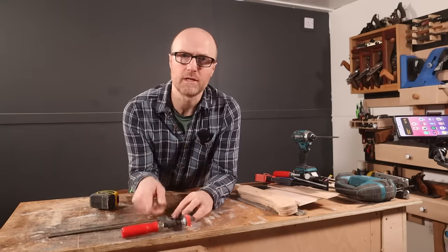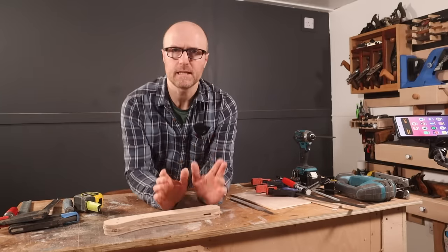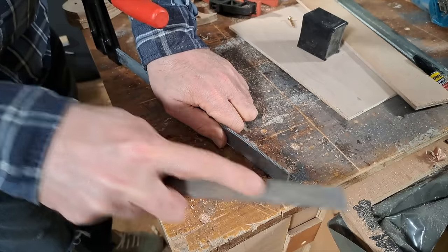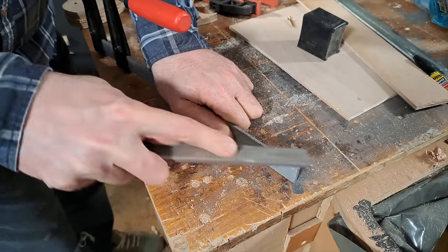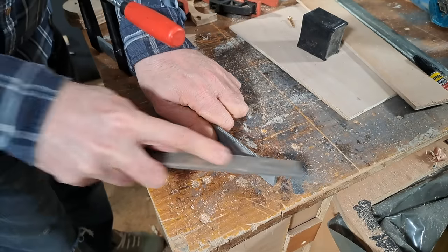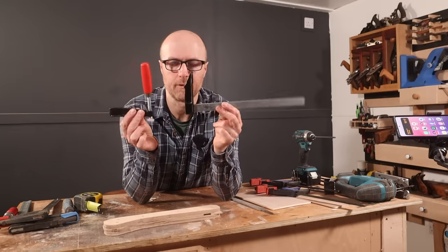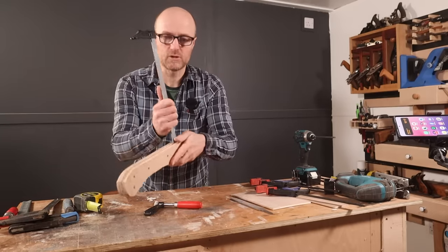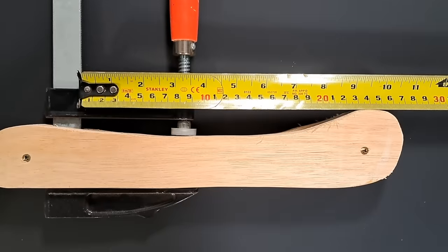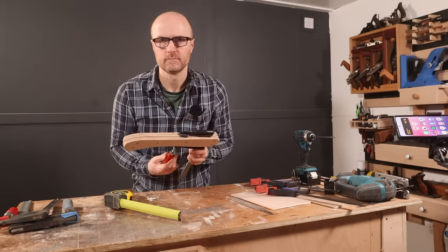What do you do if you need to clamp the middle of two pretty wide boards together? It revolves around this. First, find the knobble that stops your F-clamp falling apart — it's at the bottom and stops the jaws coming off. Then go ahead and file it off, but before you do it, make sure these are F-clamps you don't mind potentially breaking. Once it's filed off, you've got the two parts separate. Then make yourself these jaws, because with two of these — one on top, one on bottom — we can increase your clamping depth to about 250mm. They're super easy to make out of scrap wood.